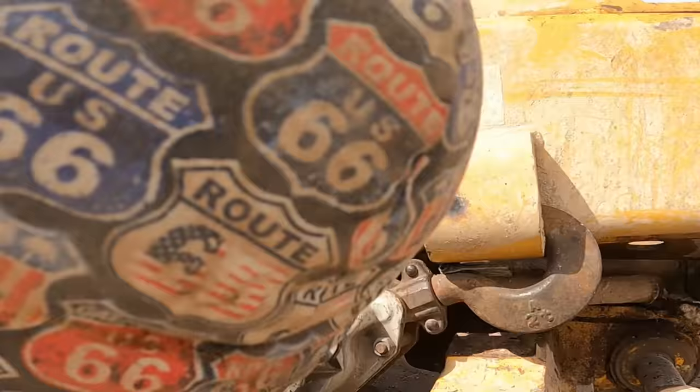So hopefully you'll see some of that. You can see some of the gaps there that I was creating, so that may be a little bit of an issue with keyholing it, but that's okay. Just for reference, this is a 1/4 inch carbon rod. So that's a fairly small bevel. Very, very small bevel.